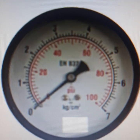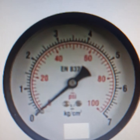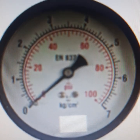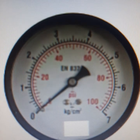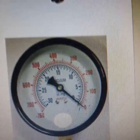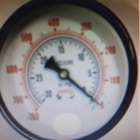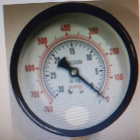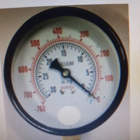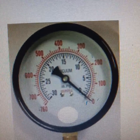The delivery pressure gauge is calibrated in terms of kilogram force per centimeter squared on the outside, and the inner ring has the pressure calibrated in some other unit. We will use the outer calibration shown in black color in this example. Similarly, the vacuum pressure is recorded by this vacuum gauge. There are two dials. The outer dial is recording the vacuum pressure in mm of mercury, whereas the inner dial is calibrated to record the pressure in some other unit.